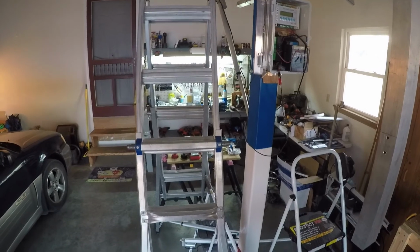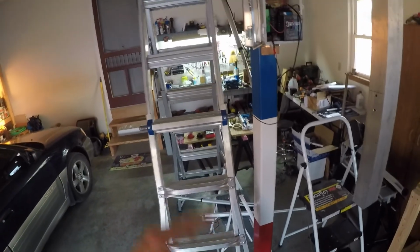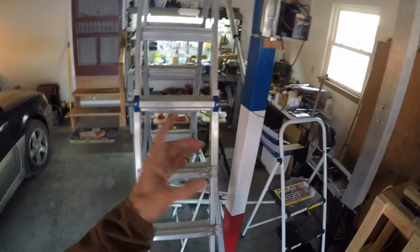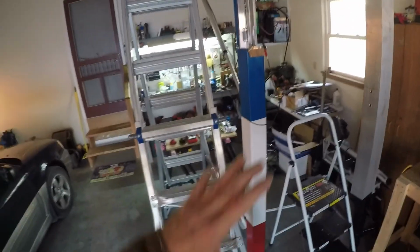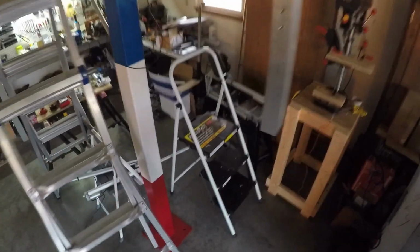And of course I'm gonna have them zero out at night, and then as soon as the sun comes up, it has a little detector that detects the sun no matter where it's at, and it'll go back to the east, pick up the sun. So you get the most out of your solar panels that way. And it's been working really well.